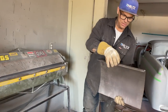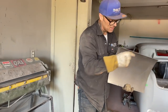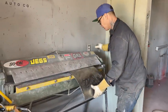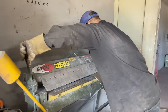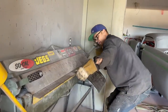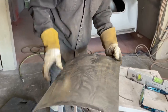Now I'm going to bend a new piece. I only bent this an inch and a half because I did not figure out when I put the square stock going straight across, I had to have it wider in the bottom than the end. If I'd made my square stock the same shape as I made the top, then this would have worked. But I did not do that, so here I go. It's called recovery. Sometimes it's a hard thing to recover from something, but I'm going to try it. Why not? No, I don't want to go backwards. I want to recover. All right, so just straighten that out a little bit. It's not quite as straight as it should be, but straighten it out a little bit. I'm going to get a measurement of 5 inches from the bottom.